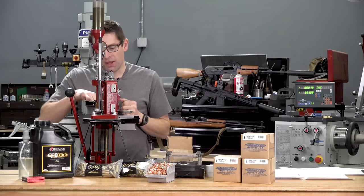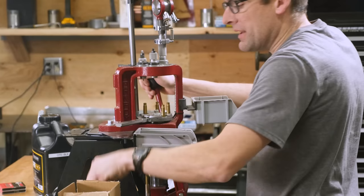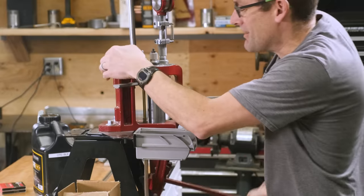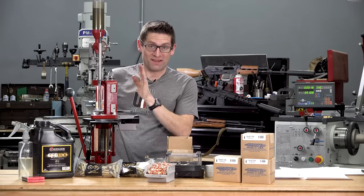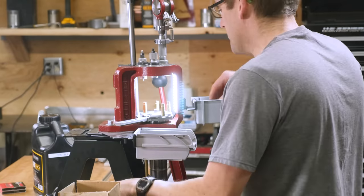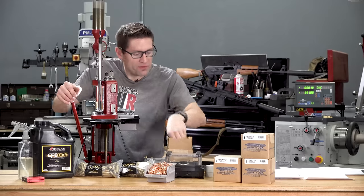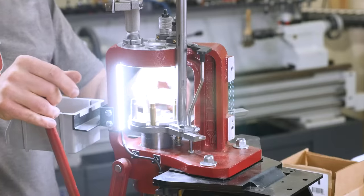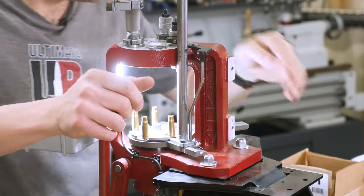I've already got the press run up. Every time we pull the handle, we're going to place a bullet in station four and guide it into the bullet seating die. Place a new case in station one, place the bullet at station four, and rinse and repeat. This is my KMS Squared UFO press light — it sheds some light on the subject. Your UR10 discount code at KMSsquared.com will get you 10% off. I also like to withdraw the case manually from station five, as 7.62x39 can be a little stubborn on ejecting — it doesn't cost any extra time.